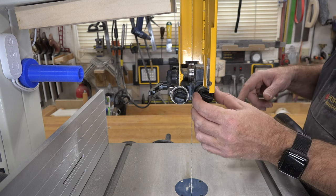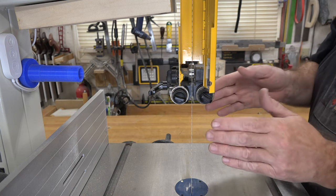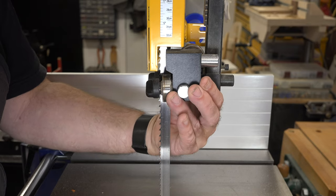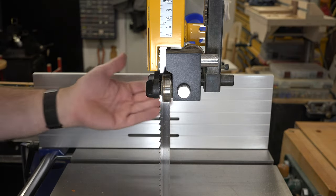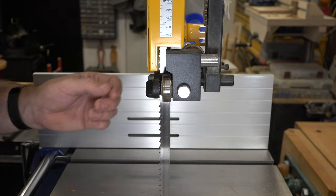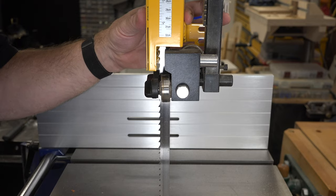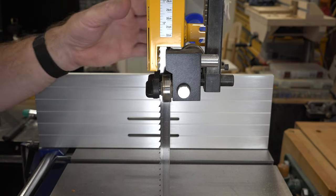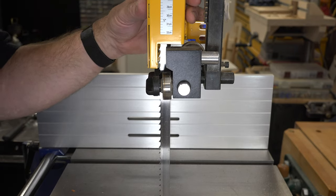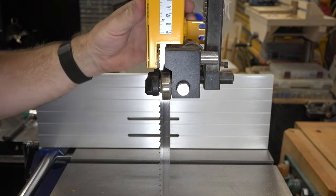The first thing we want to do when setting up these bearings is set our guide bearings front to back. Pretty much every guide assembly has an adjustment to go from front to back — mine is a little handle on the side. The first thing you need to do is look at the play in the guide post. If it's not locked in place there's still play on the worm gear, so you need to tighten that up and once tightened the play should be gone.